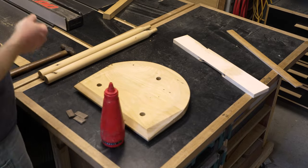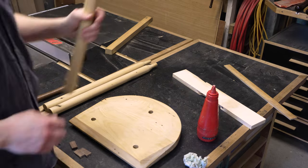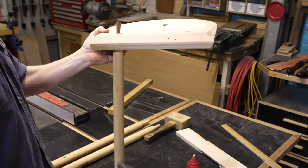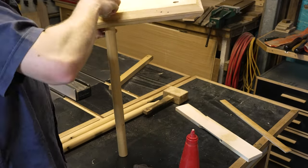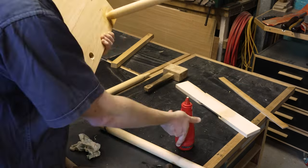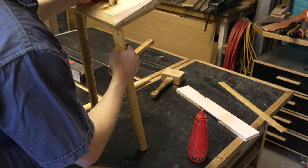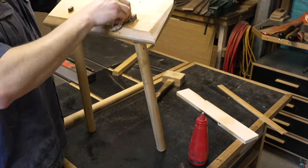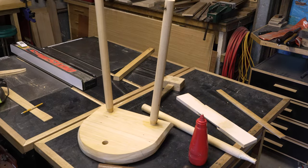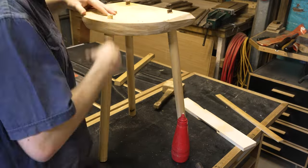Glue it up. When you're hammering your wedges in, put the leg of the stool on the table like that and hammer it home. If you listen when you're doing it, you can actually hear a different sound when the wedge is seated. I remember reading in that book that you only want to glue one side of the wedge when you hammer it home — I can't really remember why, but I think it's got something to do with there being a chance of the glue in the mortise failing.